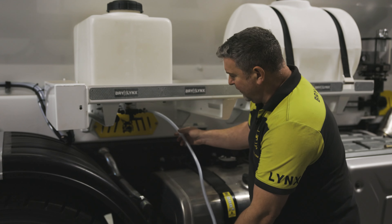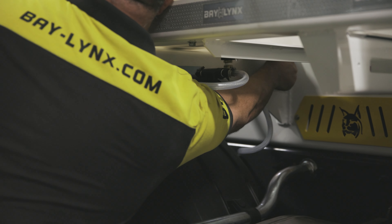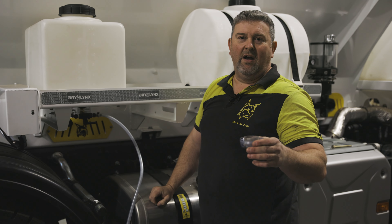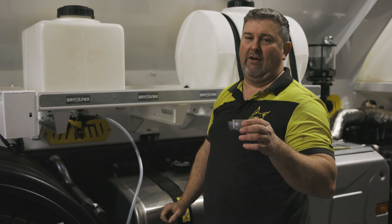Once our admixture is fully drained, we're then going to take the cap off the strainer to prevent any freezing and any potential damage to the strainer. That's our strainer cap off. And then obviously in the morning, we've got to remember that we're going to put all this back on and refill our admixtures.